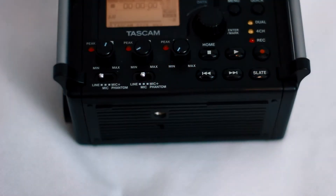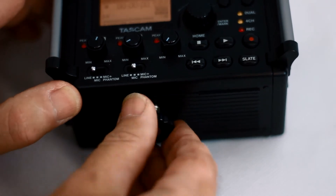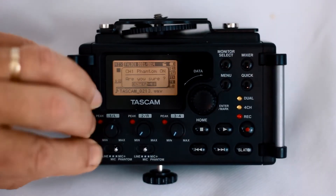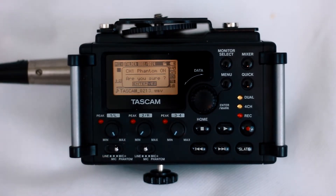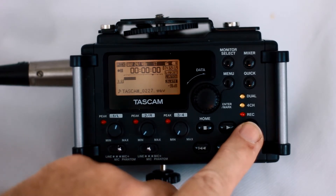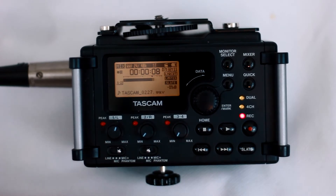It doesn't record MP3 — it's a semi-pro unit, so why would you? I put a camera mount screw on the bottom here just to hold the DR60D at an angle when I'm working on a desk. To record, I plug the mic in, select phantom power and adjust the levels. There are peak lights and a readout of the actual peak levels. Press record to arm the recorder and press again to go into record. Press record again to pause and hit stop to finish. Playback is via the line output or through headphones, which plug into the side and have their own dedicated volume control. The playback control is a bit hidden — you use fast forward or rewind to choose the file on the screen, then hit play to listen.